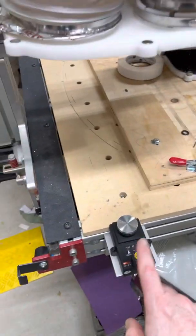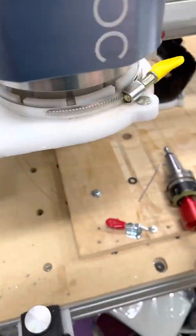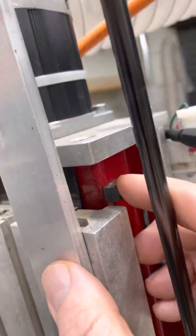The problem is, I want to toolset every time I change tools — so anytime a tool gets called up — but then if I'm zeroing off of the touch probe, how do these two know where they are relative to each other? They're accurate-ish but not super precise.